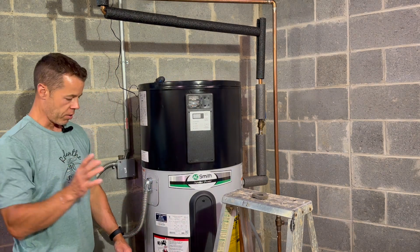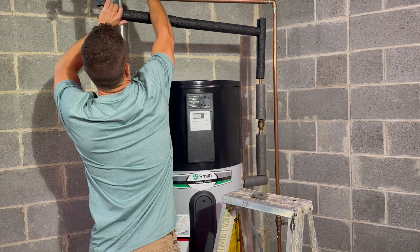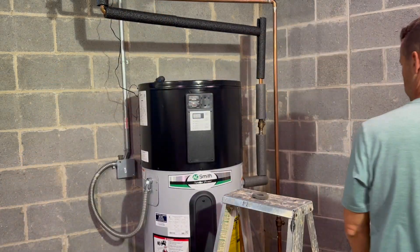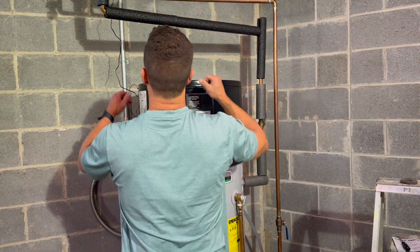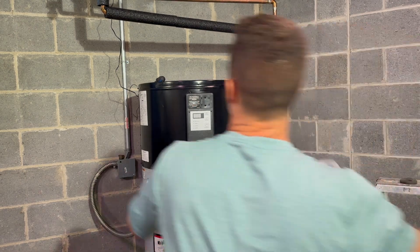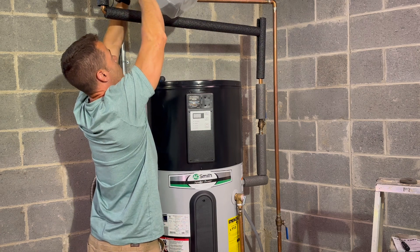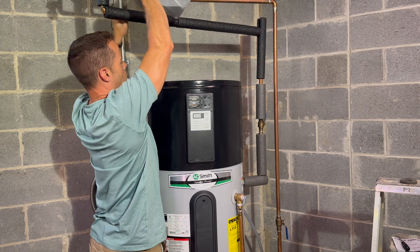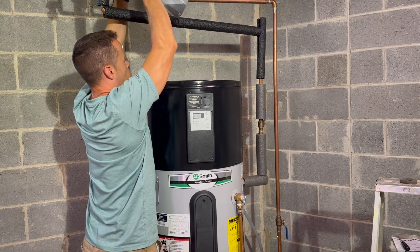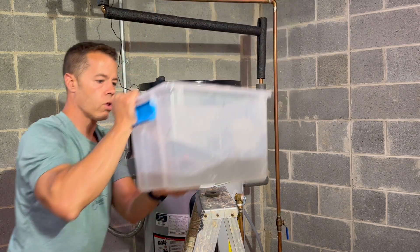We're going to put the rest of the screws in. I'm going to fill this up, then turn the water back on, and then plug this in. First things first — that bleed valve is off. I'm going to turn the water back on to the hot water tank and fill it back up. We want to bleed it though, so I'm going to open this up to bleed it. Otherwise you could open a valve upstairs, like a sink, but you've got to get rid of all that air in the tank. Once the tank fills up, water is going to come shooting out of here. The tank's full.